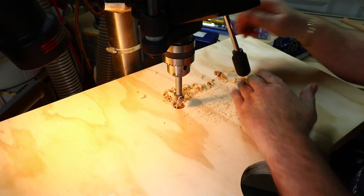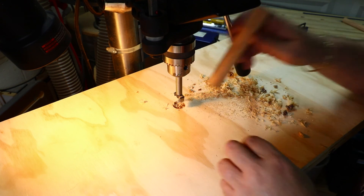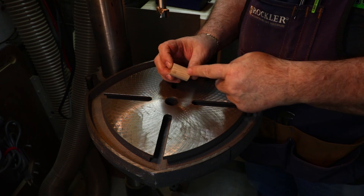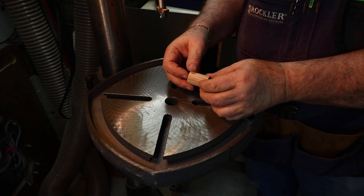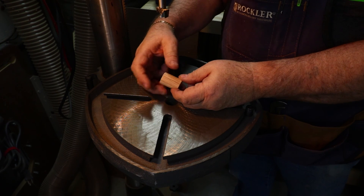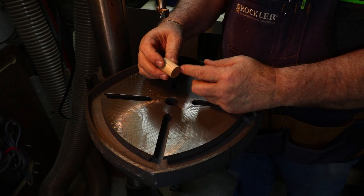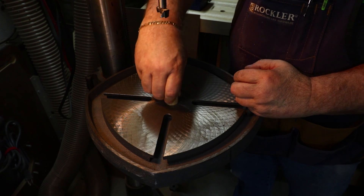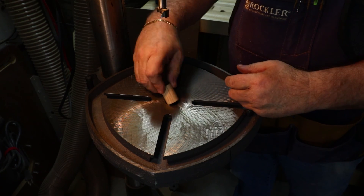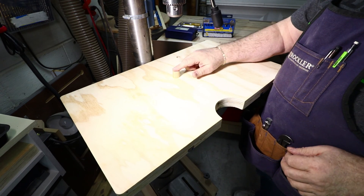Now I'm going to drill this with my one-inch Forstner bit, going about half-inch deep, with the depth stop set. That's the half-inch depth done. Now I'll cut a shorter piece of dowel to length and glue that into there — that'll be one of my alignment points. I cut this dowel to about an inch and a half length — half an inch going into the bottom of the table, leaving about an inch sticking out. I sanded around it a little bit because wood shrinks and expands through the seasons. I chamfered the bottom edge a little bit with sandpaper to help it fit into the hole more easily so it won't be a struggle. On occasion I may need to sand it down a little and wax it just to make things slide together easily.